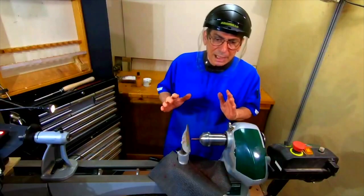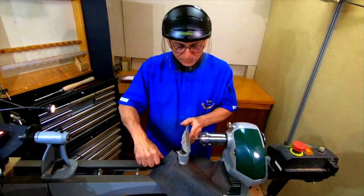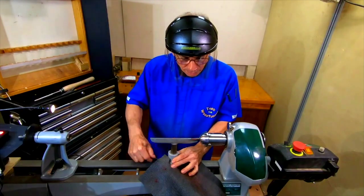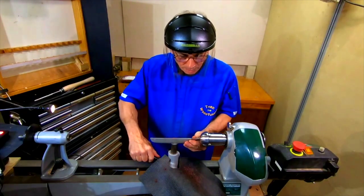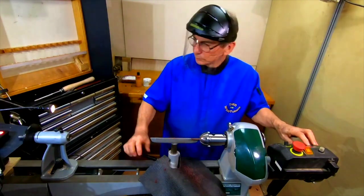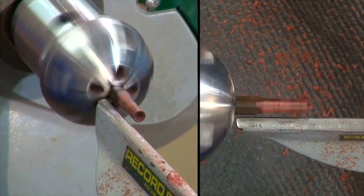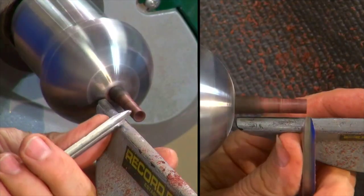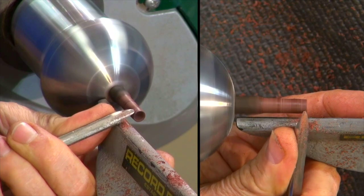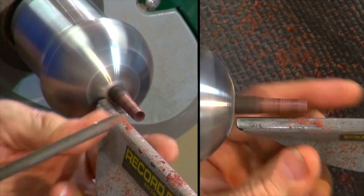again we stop the lathe and we wait until the wood and the chuck stop turning. And I'm now ready to shape the goblet. Again, using the 1/4 inch. I want a tulip shape. It's a 1/4 inch spindle gouge.